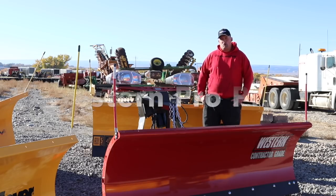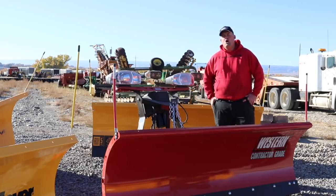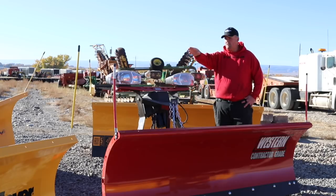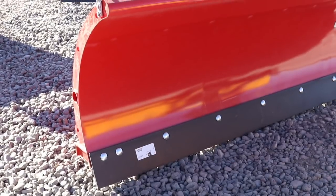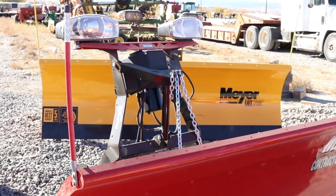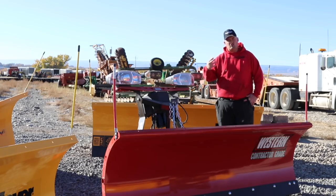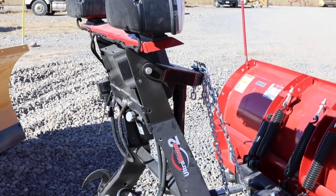This is a Western Pro Plus plow — a very similar plow to Meyer's Lot Pro. Western builds a plow for every class we've already talked about: the lighter plows like the Drive Pros, the little home plow, V plows, and the Super Blade equivalent which Western calls a Wide-Out. All of those are available with Western through us. This plow is all hydraulic up, hydraulic down, and is a trip blade plow. I can get this in a 7.5, 8, 8.5, 9, and 10-foot, with 45-degree fixed wings available — fits your three-quarter-ton and one-ton pickups and larger SUVs.